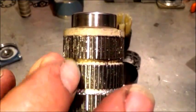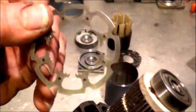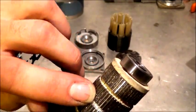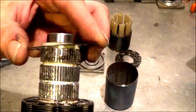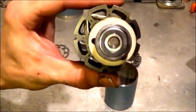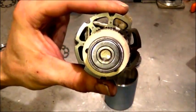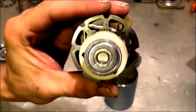In these little grooves, like I showed in the original Tesla turbine build from the other stator motor, you have to build keeper pins that'll fit. These grooves have a recess in them, so you build a little pin that slides down into that recess, which lines up with the inner teeth on this ring. Put a little keeper pin in on two sides, slide those down over the keeper pin, and that'll lock it so it doesn't spin against the inner rotor. You can now see down those holes and the blades are perfectly lined with each other — you can see right through it, more like Tesla's original design.